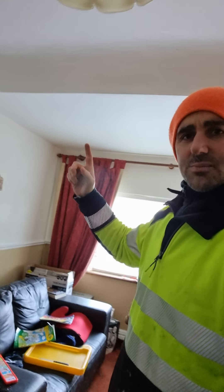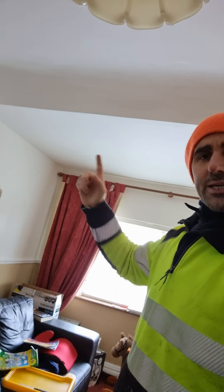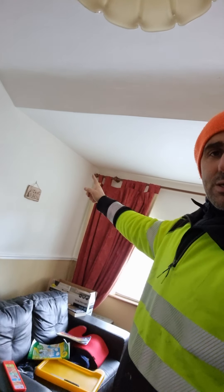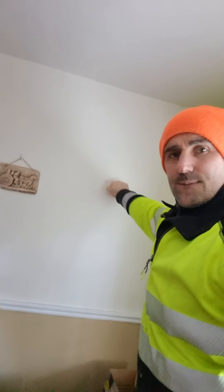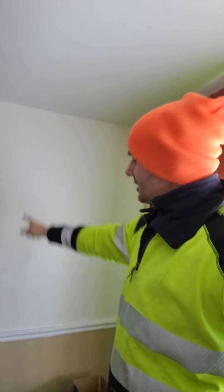When you come in here into this room, this ceiling was completely uninsulated — you get a lot of that in housing estates where little jobs haven't been done. What's happening in this roof is it's going down to a dry lining system, with battens or blobs, and because there's a cavity there's insulation in the cavity, so they're not putting insulation in the dry lining system. What you have is huge air movement coming from the ceiling pumping up and down the wall, so you need an airtight insulation system and the timbers must be permeable.